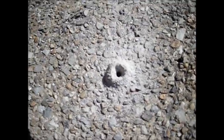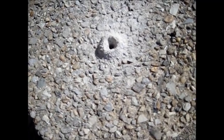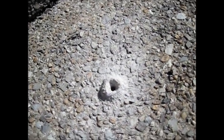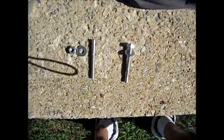You can see hole number one done, and you do each of the three other holes the same way. When you're done, blow the dirt off with a brush and then re-bore just to get the powder out of the hole. Dust them out to get rid of the soot and powder, then just run your drill through again to make sure they're clean.